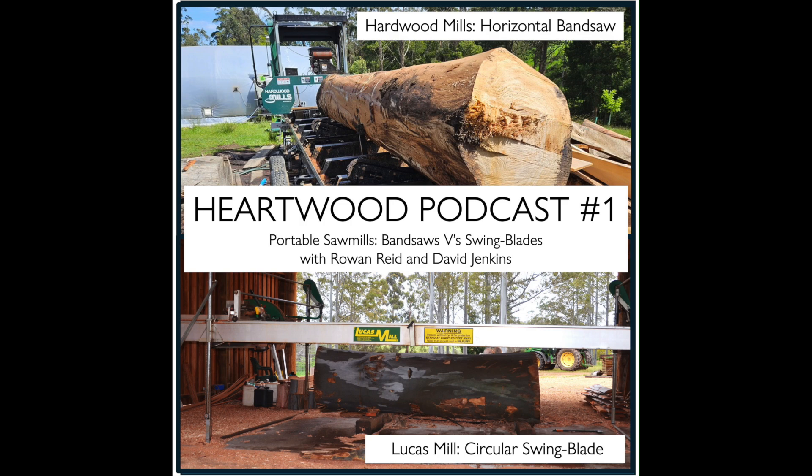The Lucas is certainly good for those big logs. If you go to a site, they might be able to push a log but not lift one — with the Lucas you can push it under the mill or build the mill over it, even in the paddock. Those big logs don't have to be lifted and moved. With the bandsaw mill, you have to lift the log onto the bench, which gets really tricky — even with a hundred-horsepower tractor and front-end loader, you can't really lift two to two-and-a-half tons.